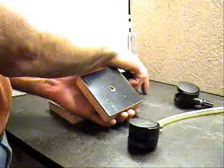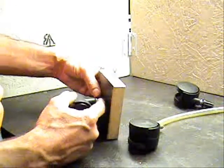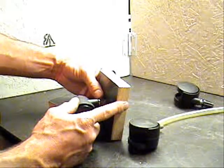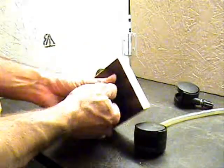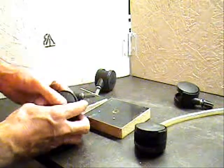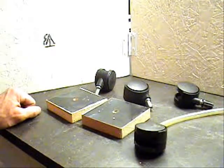And then when I'm ready, I'll take the caster, slide the axle in there, and push it in to where this is tight. I'm not going to do it now until I get these blocks mounted to the box of the cart. I don't think I'm going to need any epoxy or any glue on these. They're pretty snug as they sit, but if it turns out that it's a problem and I lose a caster, I'll go back and put some kind of adhesive in there.